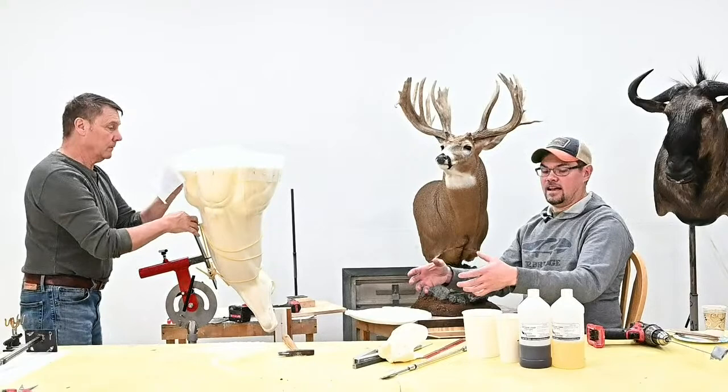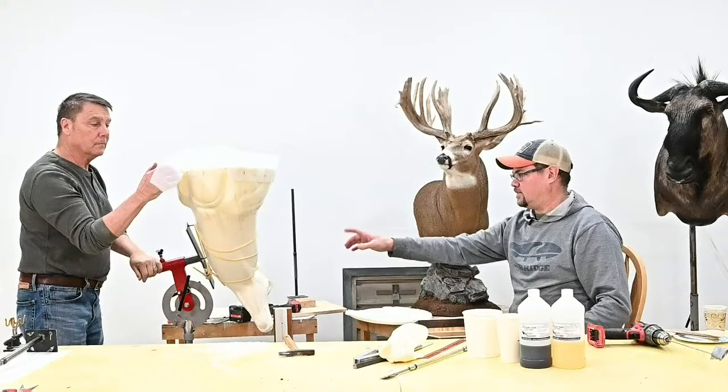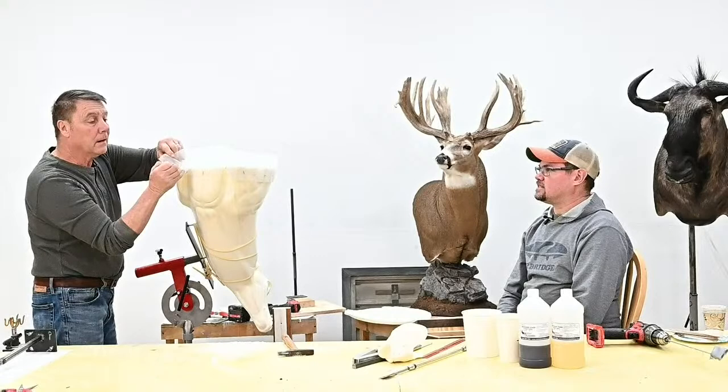There's going to be a lot of air in it. That's what our mannequins are. They don't have to be really dense. The foam only has to support the leather. But if we were to do something with the 10-pound foam, now all of a sudden that 1-foot cube weighs 10 pounds. Lots less air in it, lots more foam. So it's much stronger. What would you compare it to? Pine. Yeah.